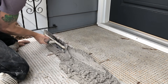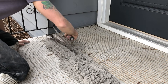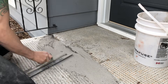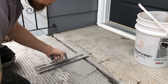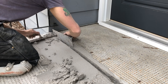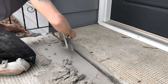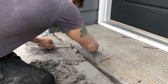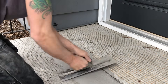When making the mix to fill in this expansion joint I made it a little too wet. My intention was to trowel it into the gap, but the product is slumping right through and falling down. The ideal way would have been to stuff some backer rod or foam into the expansion joint so the structural had something to back against. I troweled it and made it work, then made a dryer mix which holds its shape and stays on the edge, though it does add considerably more work without backer rod.